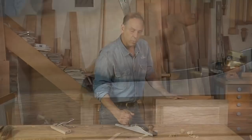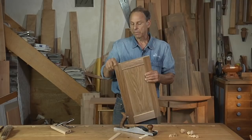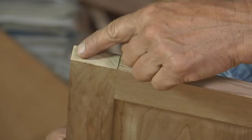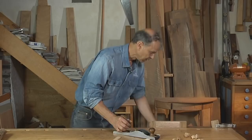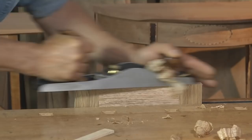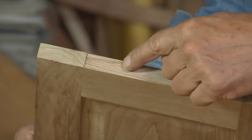What makes the 62 really ideal for this next process is cutting the top of this door — leveling it up, fitting it essentially. Here I've got a situation of going across end grain, then long grain, then end grain as well. If I've got one tool that'll cut all the way across that, that's very useful. You can see it's cutting very nicely on that end grain — very minor if any tear out, and I've leveled that up to a nice polished surface.